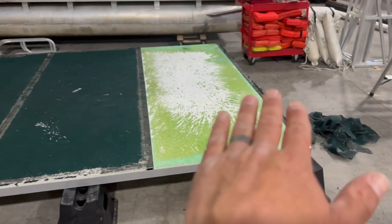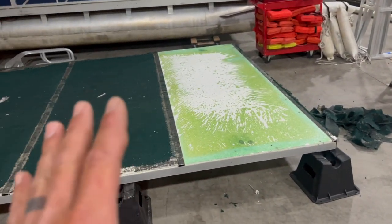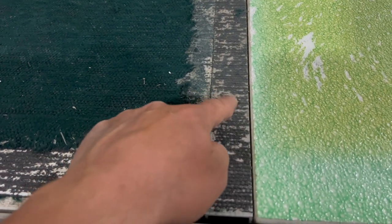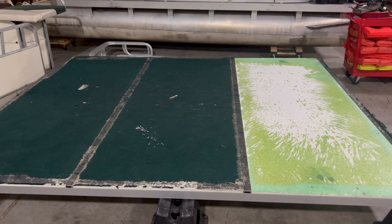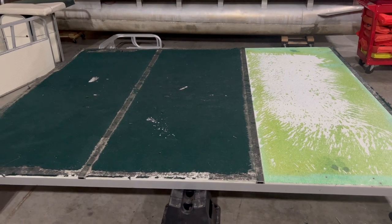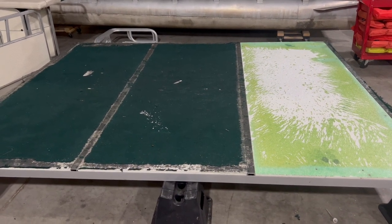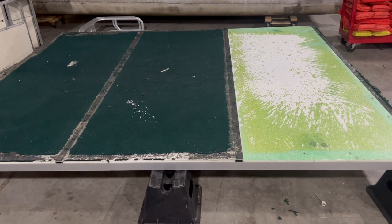First things first, I'm going to get all of this pulled off and then go ahead and secure my aluminum sheets down. If you're working on an aluminum decked boat at home that had carpet, you need to get it cleaned down to bare aluminum. What I've heard from talking to folks who have done it is that a hot power washer is the best bet. It's not fun, it's not easy, and it's super time consuming, but that's going to be your best friend. If you need to clear a whole 20, 24, 28 foot aluminum deck, sanding might work but it's going to smear a lot of that adhesive. So a hot power washer working little areas at a time is going to get back down to bare aluminum, because that's what we need for the adhesive we're using.